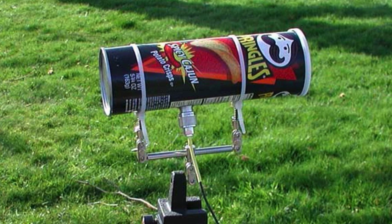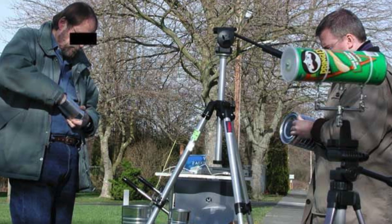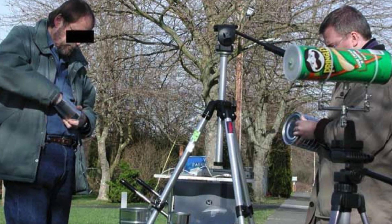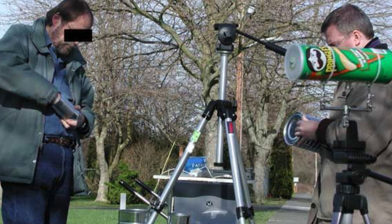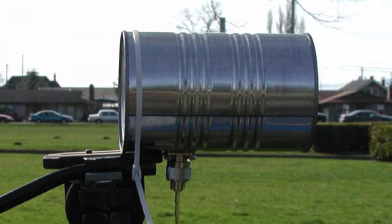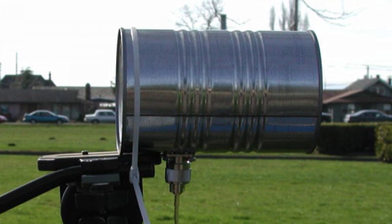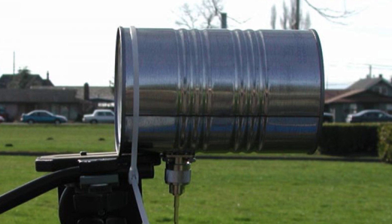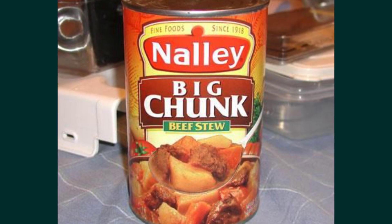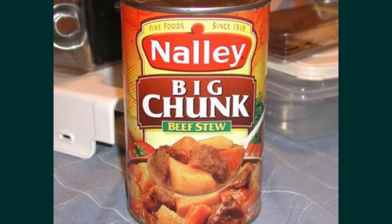Third, assemble the probe and mount it in the tin can. You'll need the piece of copper wire and a soldering iron. Cut the copper wire so that when it's stuck in the connector, the total length of both the brass tube and the copper wire sticking out past the connector is 1.21 inches. Get as close to this length as you can. When you've got your copper wire correctly sized, solder it into the connector and keep it as straight and upright as you can. When it is cooled, bolt or screw the assembly into your tin can. Put the heads of the bolts inside the tin can and the nuts on the outside to minimize obstructions in your antenna. Your DIY project is done!